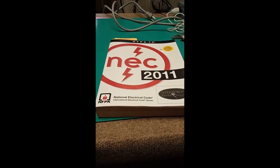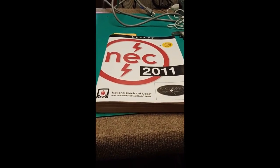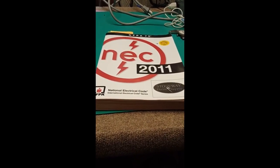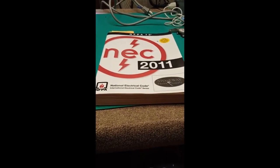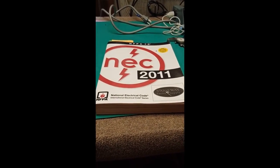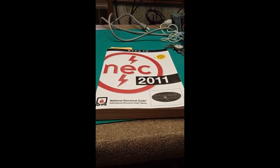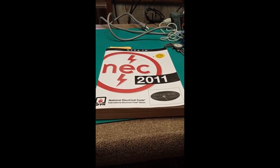This is KBYP making another pass at the question of why hams are so hung up on grounding their equipment. The idea that you have to put a metal plate down and ground all your equipment — no such thing exists in electrical code. This all revolves around the definition of equipment. Back in the 1920s, crystal radios with no amplification, VLF and LF broadcast AM receivers — those VLF and LF stations propagate energy through and along the ground in ground wave, and it was common to have long wire antennas that did not work unless they were grounded.